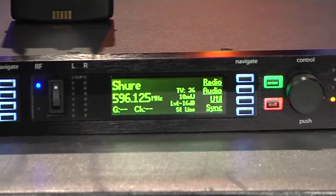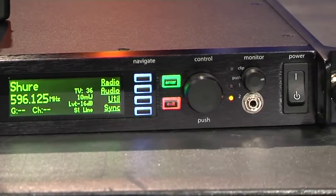You've got a couple of different antenna options you can use with the transmitter, and you can still go into the dividers. How many systems can we run concurrently? Assuming you have no RF in the area — which is a probably invalid assumption — but providing you had the clearest open air you've ever seen, you can run up to 36 channels of RF, and that's over a 72 megahertz span. In real-world conditions, that's still going to translate to quite a lot.